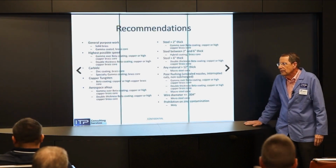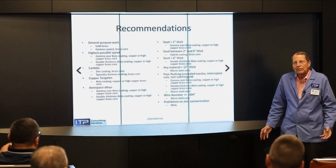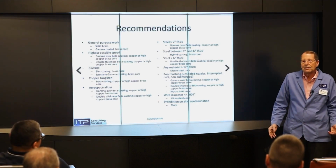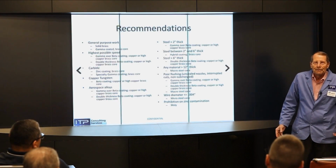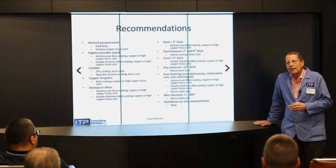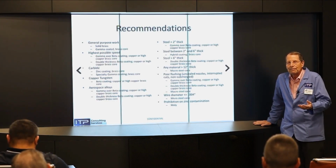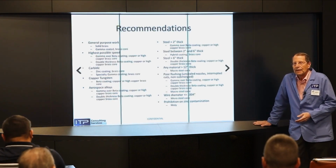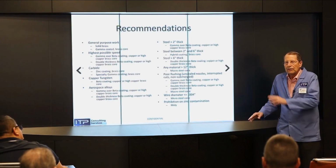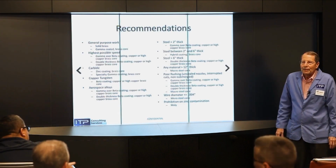Now, in the medical field, if any of you have a boat, what do you put on the bottom so that it doesn't grow stuff? You put copper, copper-based stuff. Copper is toxic to living organisms, including you. And so certain things that are implanted in the body that are wire EDM can't be cut with a copper-based wire. Well, brass has got copper in it. So all of our wires have copper in it. So we're back to moly again. Moly seems to be inert. And moly doesn't bother the coating process in aerospace. Man, I'd hate to be cutting production with moly.